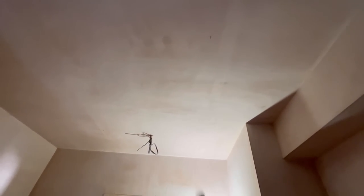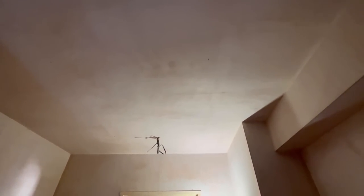In fact, it's further away. So luckily, all I did was pull the cable back to here, to this one. And the joist is already drilled out anyway, so we should be able to fish through it. So I'm going to take a chance, take a risk, and drill a hole where there was one originally, and then push the wire back through. So you may or may not see that, because I may be doing some swearing.